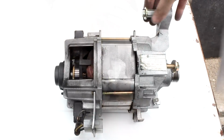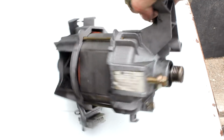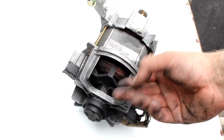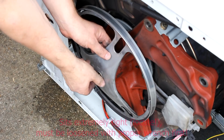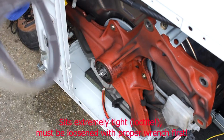This is just a sign of wear of the motor brushes, and well, it's carbon dust from those graphite electrodes or brushes. And one day those brushes might have to be replaced, but in that case you can just order replacement parts online. But I don't just want to retrieve the motor itself, I also want to have that entire transmission or belt drive assembly.